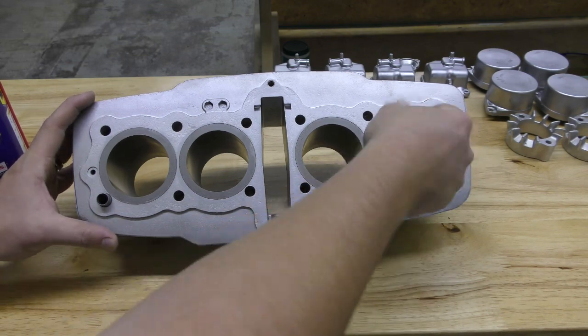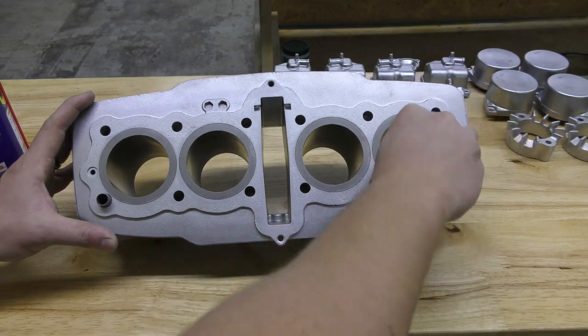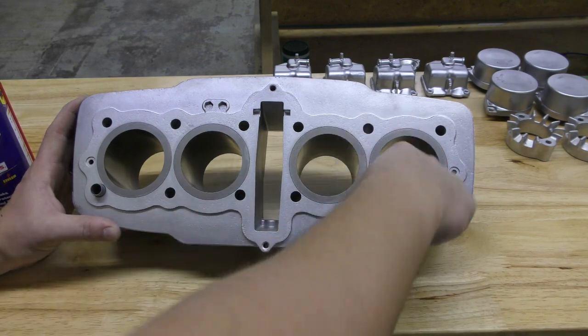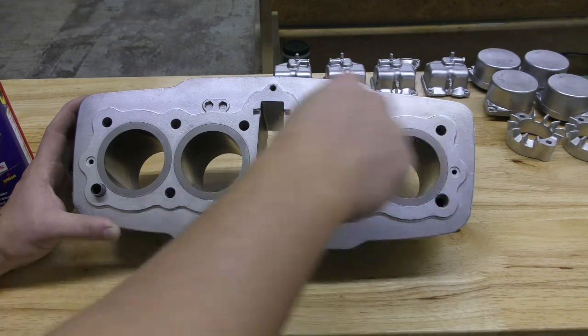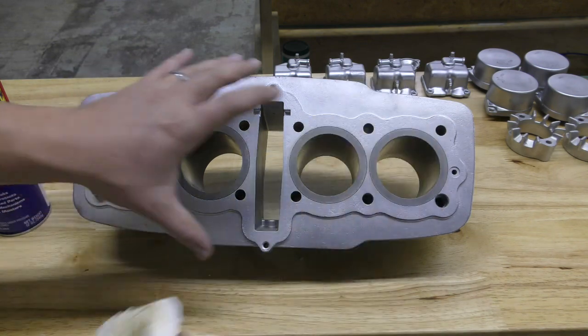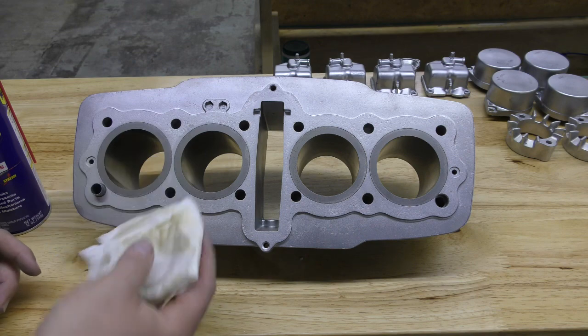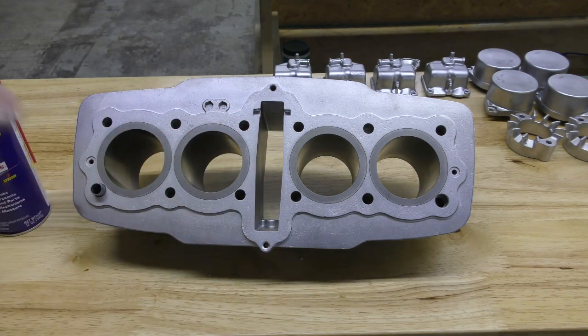Now, to normally inhibit against rust in a vapor hone system, you can use a rust inhibitor in the water, which I do recommend. However, a lot of times some of these steel parts can still rust even after you've coated the part while wet blasting, rinsed it off with rust inhibitor, or dipped it in a dip tank with inhibitor. So I always use the WD-40 method to wipe down any ferrous metals.